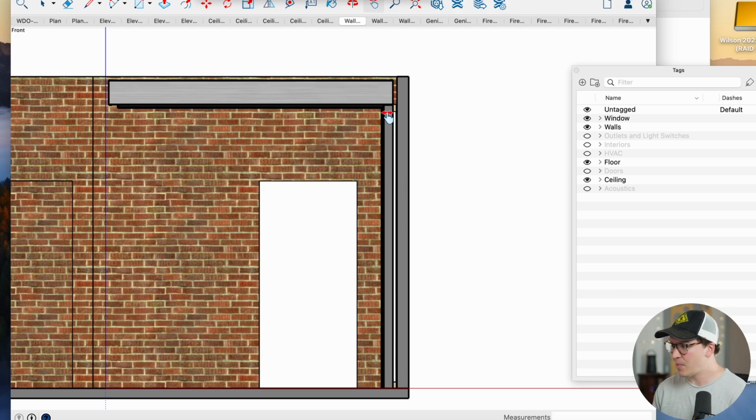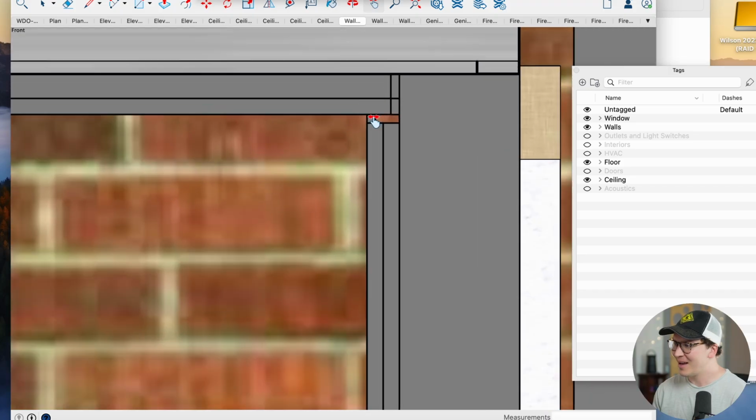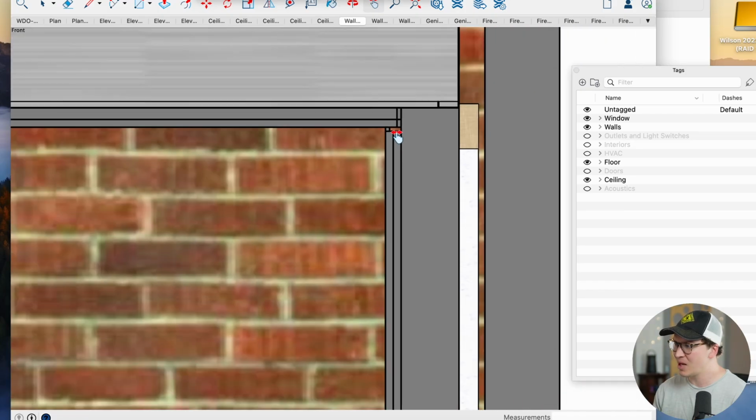And then we're building a metal framed wall on the inside here, and then using 2 layers of this Jaya board, which is 12 millimeter Jaya board. Usually I recommend 5/8 inch drywall. And then right here you might notice these little weird things, and what these are is the backer rod and acoustic sealant so that our ceiling and our walls do not technically touch each other, which is helpful.